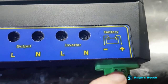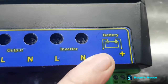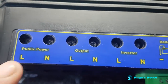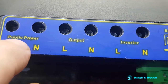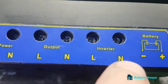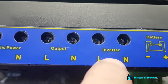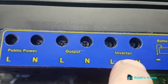On the right you've got a connection to your battery — this is purely to monitor the state of charge of your batteries. This is the output, so to this you connect a 240-volt socket. There's your public power — whoever's providing your electricity — goes in that side. And you're thinking, where's the earth? I'll get to that. And this is the inverter — a box that converts 12 volt to 240 volt. I've got an inverter, about two and a half kilowatt. So that would technically be your solar side, and that will be your mains power side.